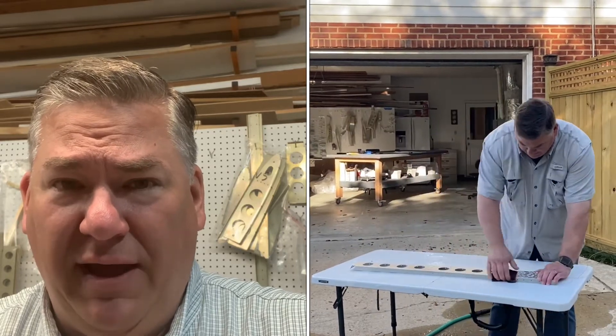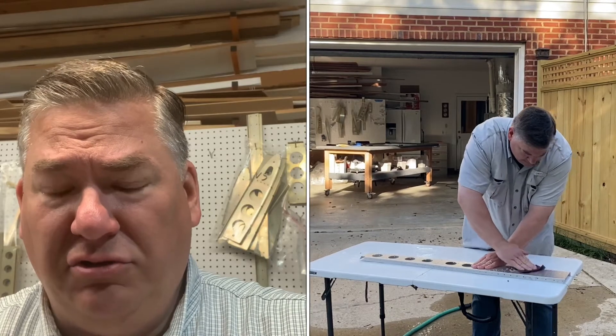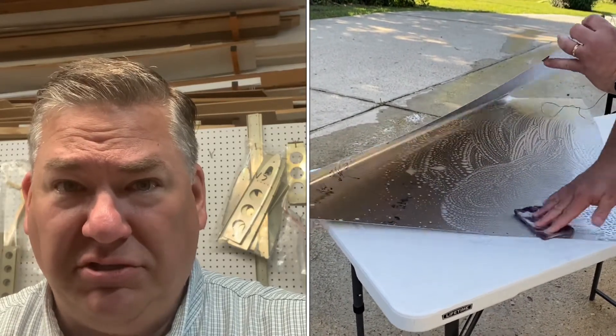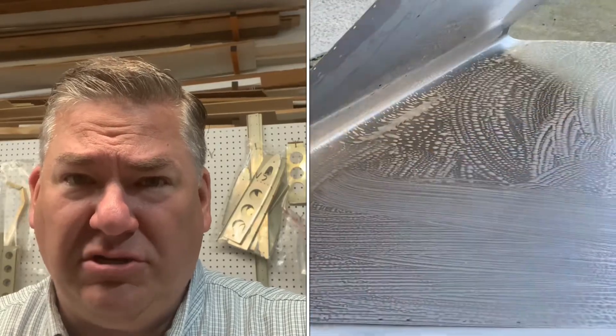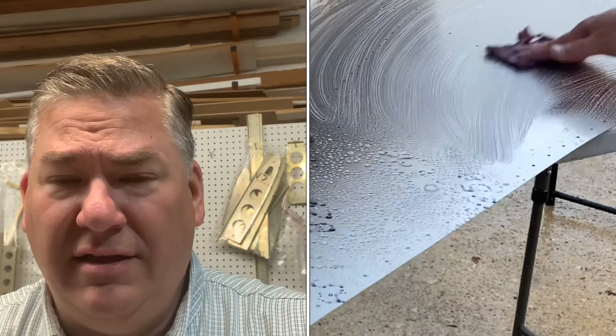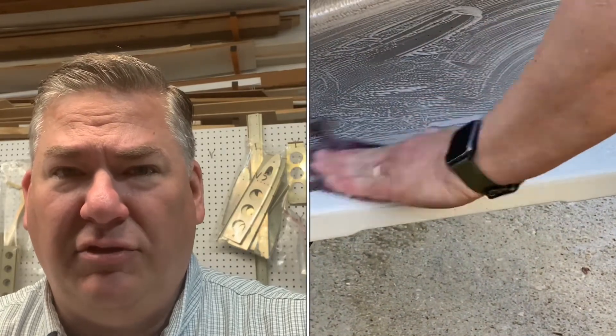Basically you start off with getting your parts labeled, setting up somewhere outside, which is what I chose. I got my hose and some Simple Green — it's Simple Green Aviation Extreme — in a spray bottle. I have a Scotch-Brite pad; I'm using the red ones, kind of a maroon color. There are about three steps I'm taking. One is to clean the part — you need to get all the manufacturing oils and that sort of thing off your parts. The second thing is, if you're going to prime, you want to scratch up the surface to give the primer something to bite into — that's mechanical adhesion. I'm using Scotch-Brite pads and they recommend doing it in a checkerboard fashion, going two different directions.